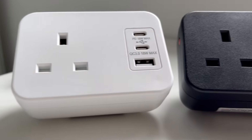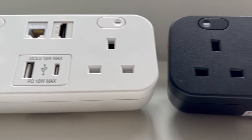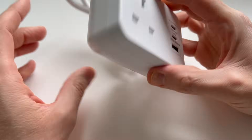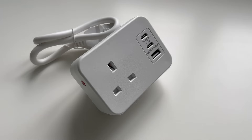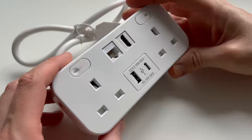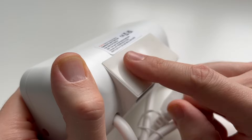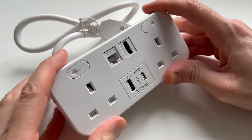This allows you to plug directly into a socket outlet if the RCD protection has been provided at the consumer unit or the distribution board. Moving up the flex, which is half a meter long and has a chunky 1.5mm squared CSA, we get to the unit itself. They're available in either white or black and come in one or two-gang variants. They're a really nice, solid-coloured unit with rounded corners, designed to sit on this flattened section, which holds the front at an angle of about 45 degrees, giving you easy access to the sockets without putting additional strain on the leads where they enter the plugs. The flattened section also has a pad fixed on it that, while not sticky, offers an area of grip to the outlet, so it's not inclined to slide away from you every time you connect to it.